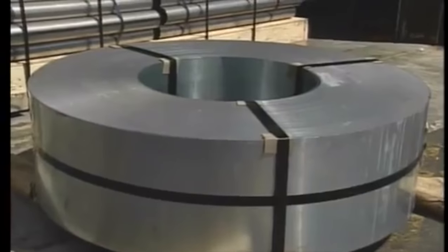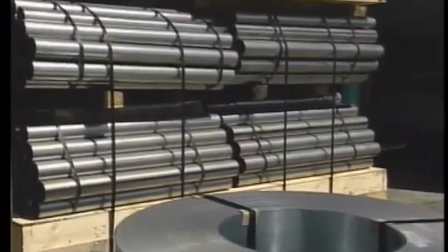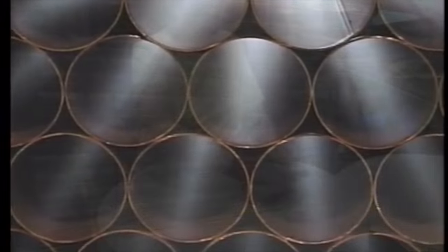Tube hydroforming is used primarily to shape ductile metals. In the case of bicycle frames, this is almost always aluminum. The material used should exhibit good fatigue properties, high energy absorption, acceptable corrosion resistance when coated, and excellent coating properties, making stainless steels, aluminum, copper, and copper alloys common choices.